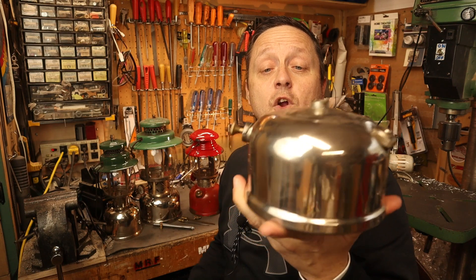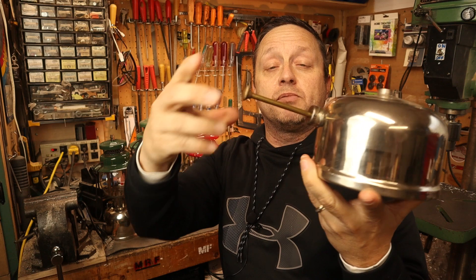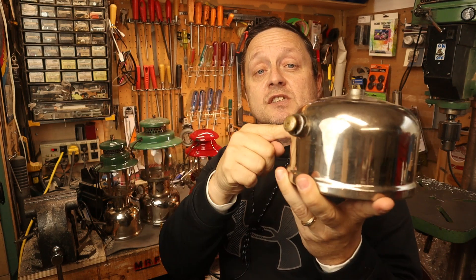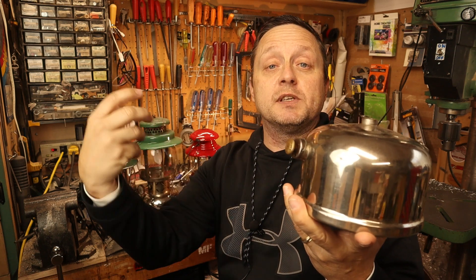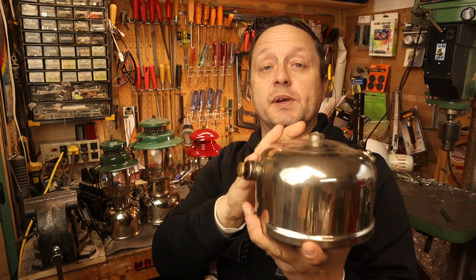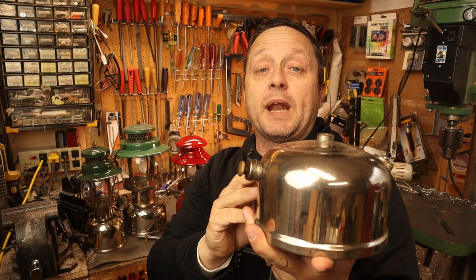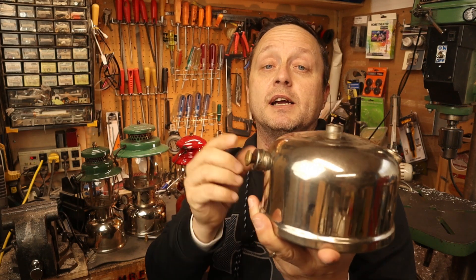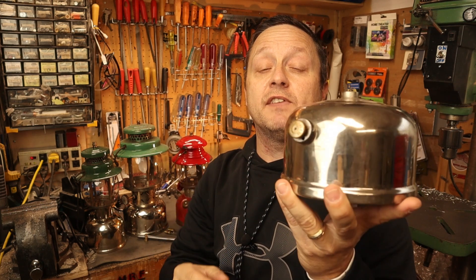In this video I'm going to show you how to clean that check valve. Here I have a Coleman fount or tank, and this is how you pump it up — put your thumb on the hole and pump it up. At the base of this tube there's a little brass check valve with a ball in it. It allows you to pump air into the tank and doesn't allow air to escape, so it can maintain its pressure for the lamp to operate properly. Over time, if you leave fuel in it or get dirty fuel or debris in there, that ball doesn't seat properly anymore inside the check valve.